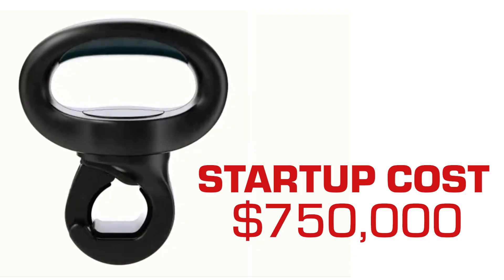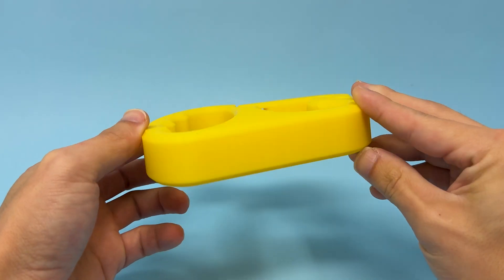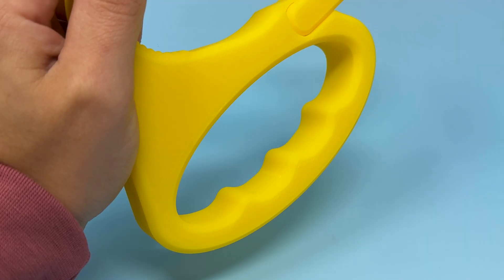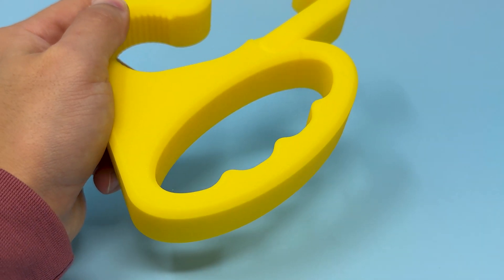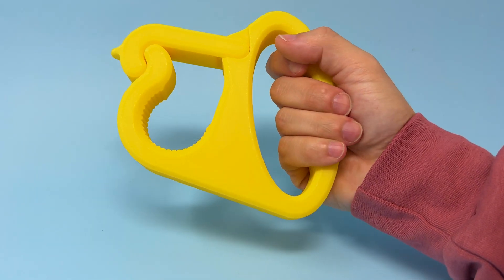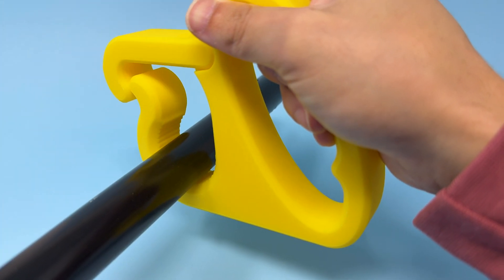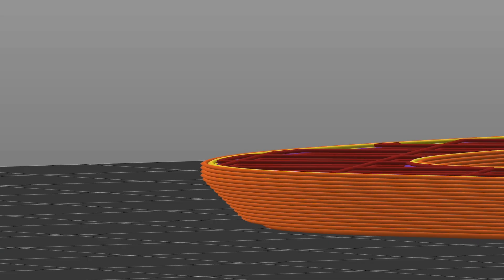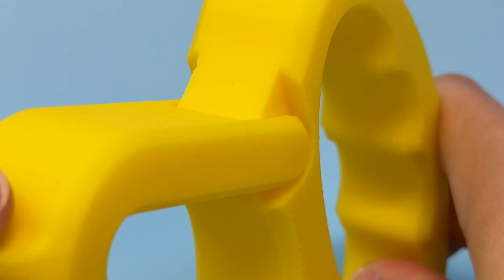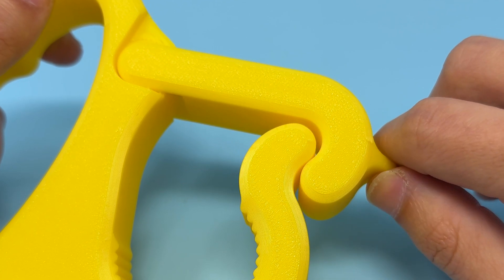But all of that could have been avoided. We went ahead and mocked up a prototype of the Lugbug as we would imagine it being 3D printed. We followed the overall design so that it rotates your grip around the handle, placing you 90 degrees with the handle of the kid carrier. We still have the front clasp and a back hook. The chamfer is on the bottom so it fits on the print bed, and we have a print-in-place hinge so there's no additional assembly.